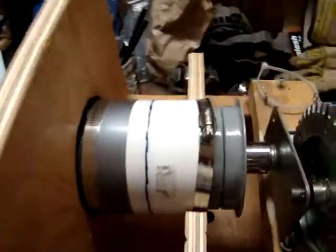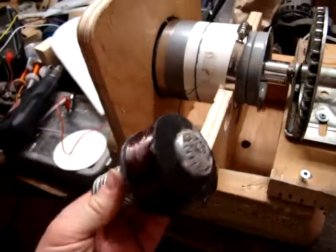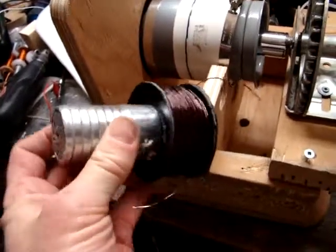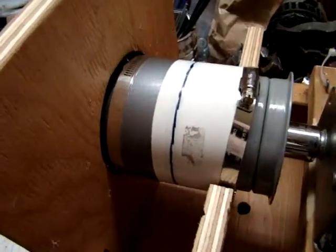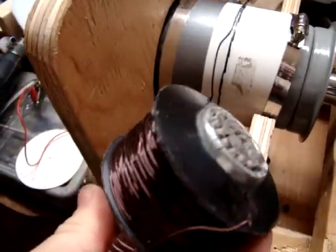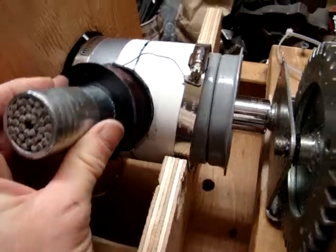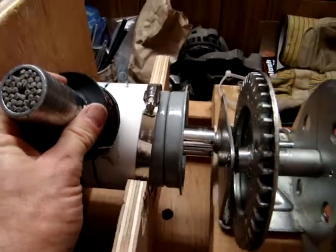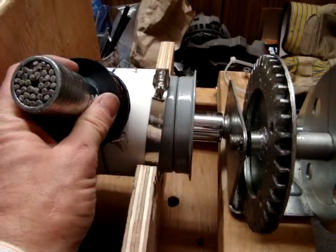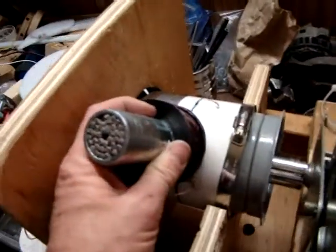The coils will have their cores aligned along here — hopefully something like this one, maybe a little narrower. These were the coils I had on the large stator down here, which was a single-phase thing. I want to make this three-phase with nine of those. I only have five at the moment, so I'll have to make some more. In the meantime, I can use this as a test bed by connecting individual coils along the side and measuring the voltage and current output from individual coils while I crank the rotor with the gear system.